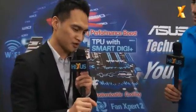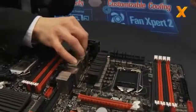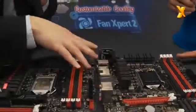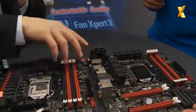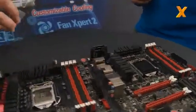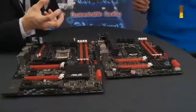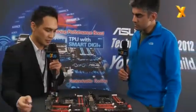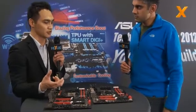I think the most noticeable feature will be this LAN card. As you can see here, we bundle this Mini-PCI-E combo card. It has two ports at each side — one will give you Mini-PCI-E with Wi-Fi and Bluetooth support. And on the other end, we offer you the possibility to use M-SATA, which you can use with Intel Smart Response Technology.